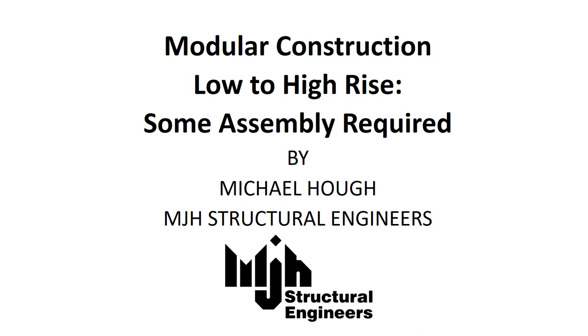The Vision Modules are constructed with a steel channel perimeter into which a concrete floor slab is poured. The walls are made up of steel box sections which provide support to the modules above. A steel roof truss provides weathering to the rooms, access on site and allows space for services. The structure of the building is contained within the modules assembled in the factory and delivered to site. The system uses integral corridors manufactured as part of the module also, meaning less modules, less transport and cranage. They also allow the building to be weathertight quickly and allow the room services to be brought close to the core for on-site connections.